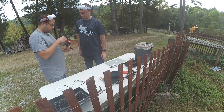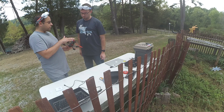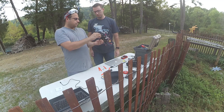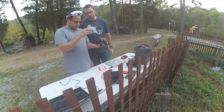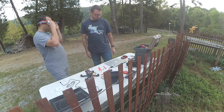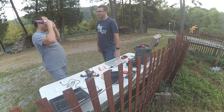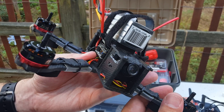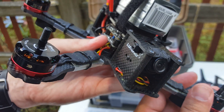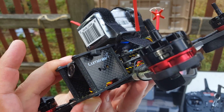So then the next thing I think we should do is look at your camera. Maybe the sensor is loose inside. We know we saw the vibrations a little bit in the high def cam, but that just means the vibrations are there. Your camera is just friction fit here — could it just be loose? I think it's side-to-side too. Let me look at the footage. I have a theory that maybe what's happening is just that the camera is loose in its own mount and it's vibrating up and down. So I've put some rubber tape here and affixed the camera so it now cannot move, and a little zip tie around it. We're going to see if that fixes the issue.